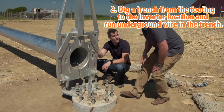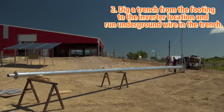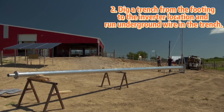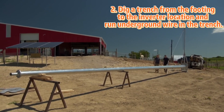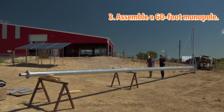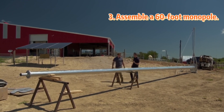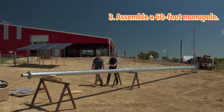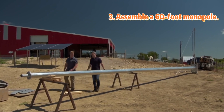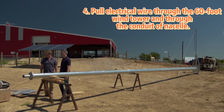So we've got a 1.5 kilowatt wind turbine. It's feeding power down through that conduit, ultimately to the inverter. We've got 3 kilowatts of solar and about half as much coming out of the wind. We've got a 60 foot pole, pressed fit together in 4 separate sections. With wind, it's all about wind velocity — the higher you go, the more power that's available to us.